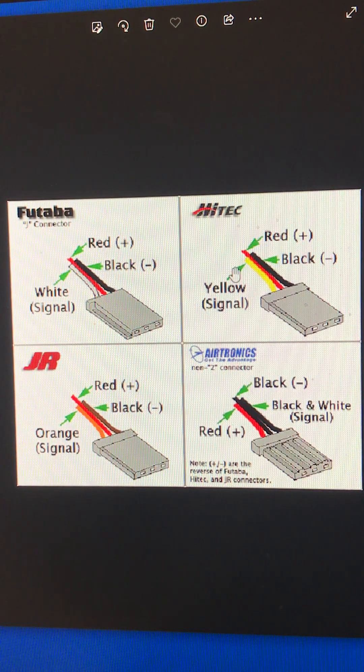The one that's hard is the Airtronics — you don't see them much anymore, but the negative is in the center, white is signal, and red is positive. This is nowhere near any of these or a Flywing product. That's why I like Futaba — it's pretty fail-safe for novice flyers. And this is what we're seeing with Flywing products: mostly novice flyers who thought they'd never be able to fly a helicopter, but now they can. Flywing made it easy, but when these things crash and you have to rebuild, color-coded wires would be a lot easier for a newbie.